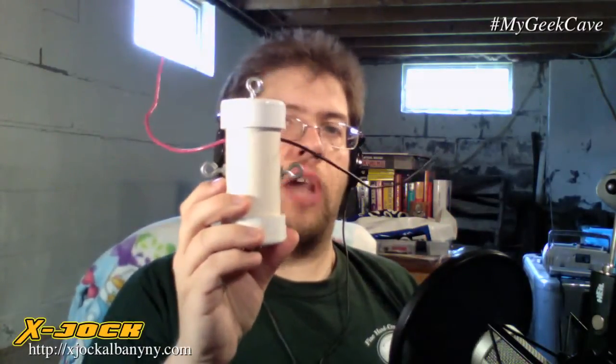All the parts for this I basically got at the hardware store and Radio Shack. Essentially it's just inch-and-a-half PVC pipe. I'm going to take it apart because it's not completely together yet. It's basically an inch-and-a-half pipe with a couple of eyelets screwed into it — I drilled a couple. And then I took a cap and drilled a five-eighths hole for an SO239 coaxial antenna connector.